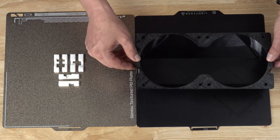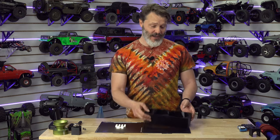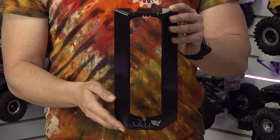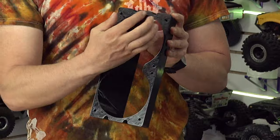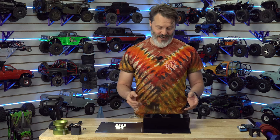The one issue I was having last time was that some of my parts were not coming out flat. There's still a tiny bit of bow to some of these parts, but this is because of how I've designed them — this one having a relatively flat edge with hard corners that transition into a round portion. As it cools, it pulls the entire thing. So I tried lots of different beds and tried increasing the temperature. We got the engineering version so that it had the heated chamber inside.